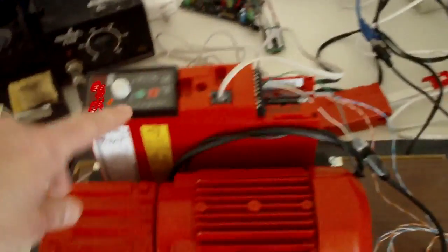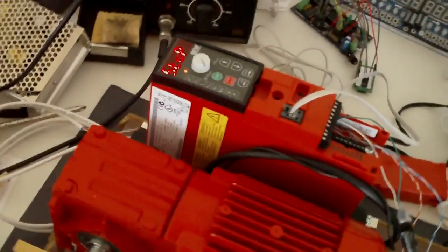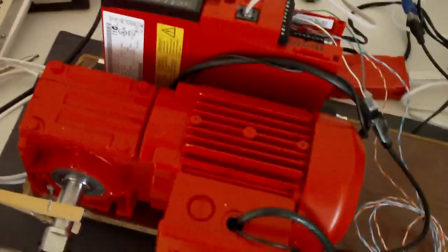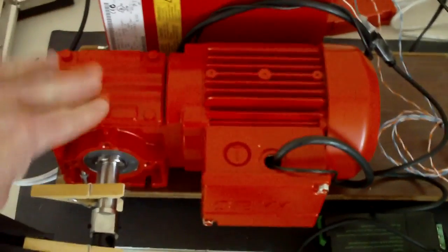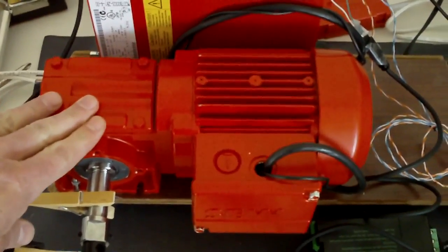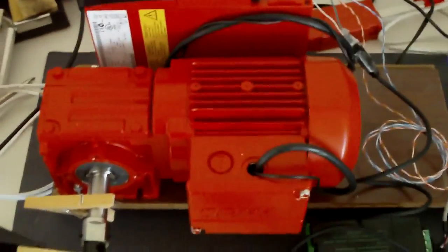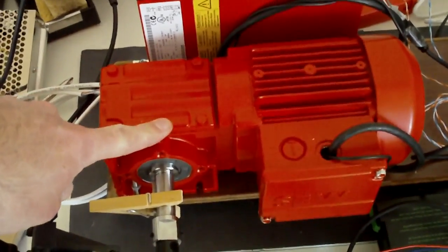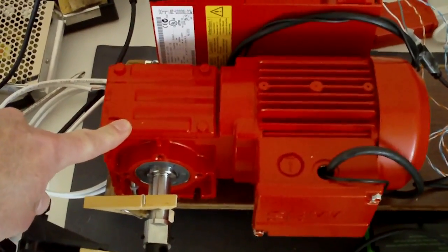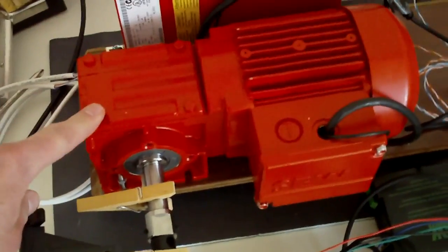I have here the MobiTrak B inverter connected to an AC motor. That's the smallest model — it was given to me just for testing, so it's just 90W, not really big, but it's great for demonstration as it has a gearbox. This gearbox is 1x63, so it reduces the speed of the motor about 63 times.